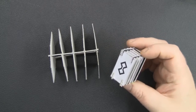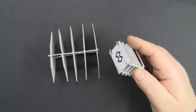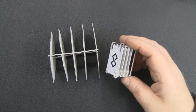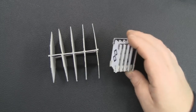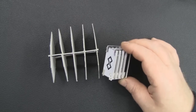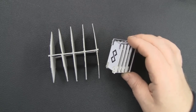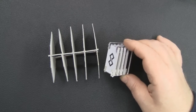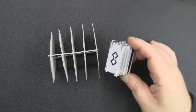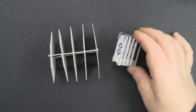Now this one in my hand here is a 5.8 gigahertz one, and another reason why I looked at PCB material is because people have asked me over the last year or so if I would design one of these for the 5.8 gigahertz frequencies, but unfortunately the tolerances involved, i.e. you have to get down to 0.5 of a millimeter. It would be virtually impossible to make that out of wire, to get it with any degree of accuracy. So if you use PCBs, you can actually get that 0.5 millimeter tolerance, no problem.